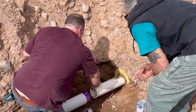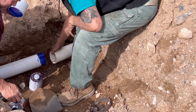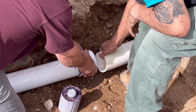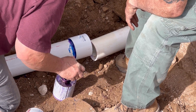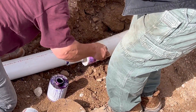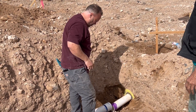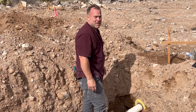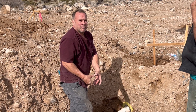Pull that out of the way. So what we're doing here, if you don't understand, is we're reconnecting the sewer back up to our septic tank. The reason why we had to do that is we had to cap off the pipe to do our pressure test. Why was it so hard, Richard? I think the pipe had been underground for six months, and maybe the weight made it oblong, kind of bit.